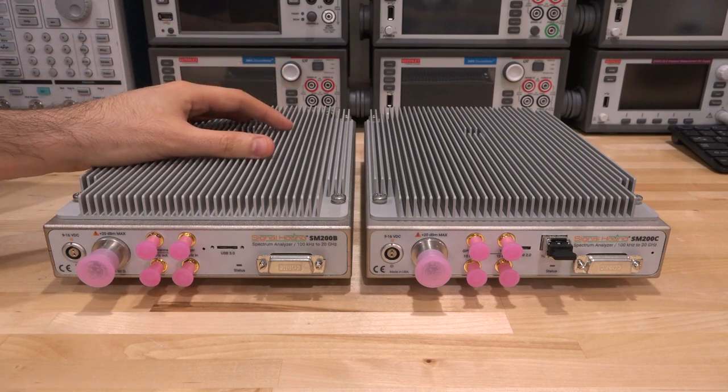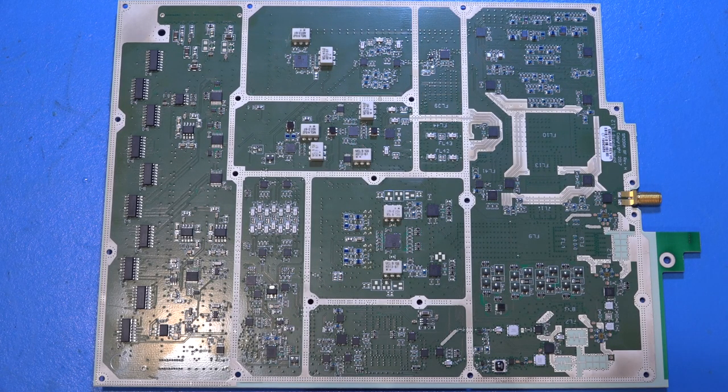This instrument is made of two main PCBs — one with all the RF components and another with the FPGA and synthesizers. Before the teardown details, consider the design challenge: supporting a terahertz-per-second sweep with good phase noise, linearity, and harmonic suppression — without a preselector, because you're dealing with 160 MHz instantaneous bandwidth. The architecture is therefore very different from a traditional spectrum analyzer.